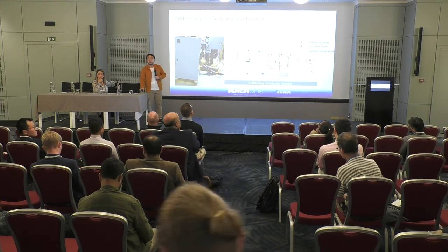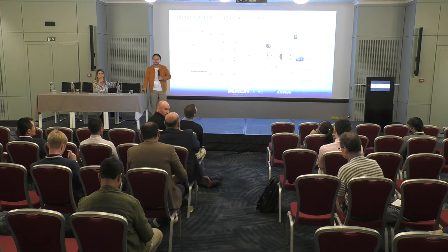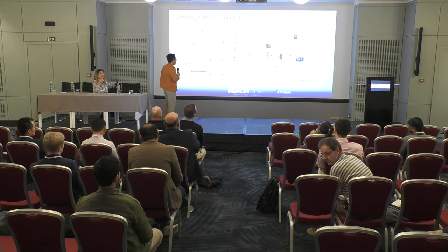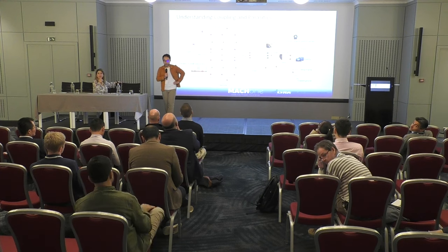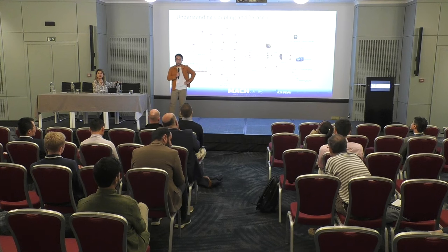All right. For that example you had there, was the chassis ground on a dirty earth and the power electronics put on a clean earth? So normally when we design facilities, we have different earth bars. Yes. So those would be on different earth bars and then joined together far away. Yeah, I understand your question.